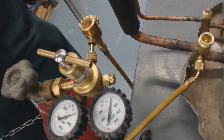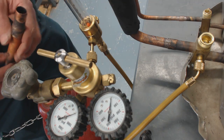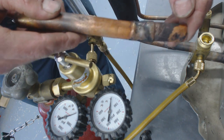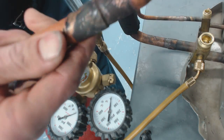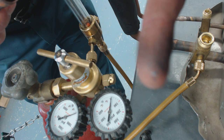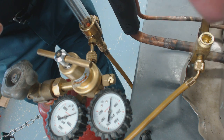It's very important to run nitrogen through as you're brazing because you end up with all this oxidation. I'm going to show you a pipe I just quickly brazed. I'll put my finger in — you see all this stuff on my finger? It's all shiny and flaky. You don't want that inside all of your refrigerant piping.